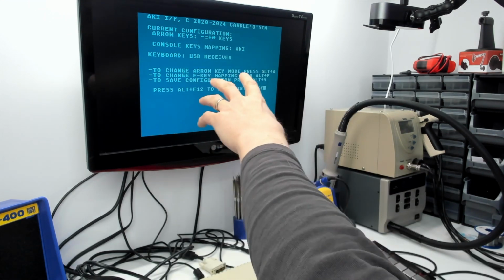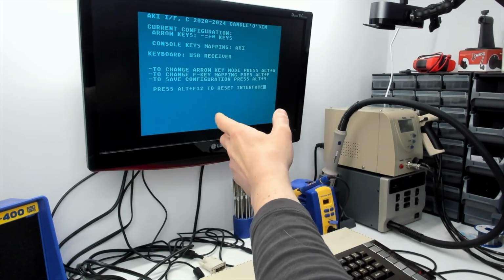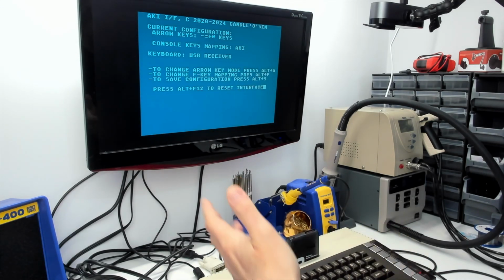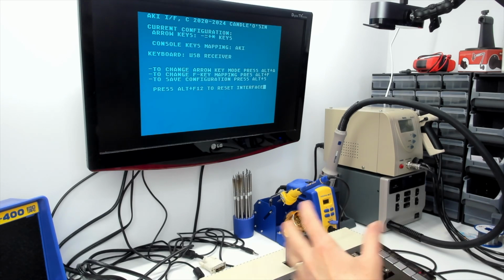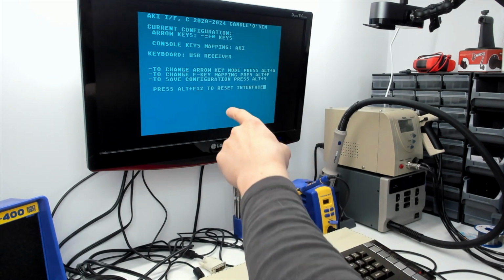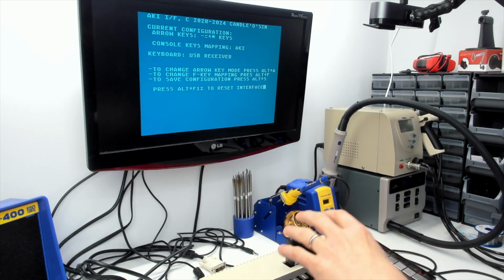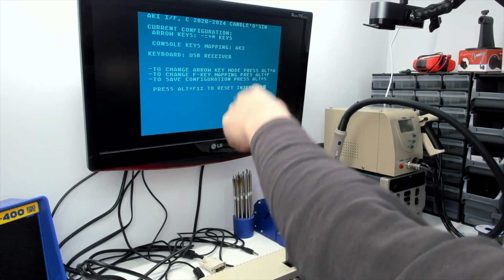Another thing you might notice is that every time we display this help text, the case of the text changes, it reverses. So one time it's in lowercase with a capitalization, and then the next time it'll all be in uppercase. So what I think's happening here, because the first time you display the screen, after just turning the machine on, the operating system handles the upper lower case of the keyboard with a flag, controlled by the caps key, of course. So what I think's being done here, I haven't actually talked to Candle about it and confirmed it, but I'm assuming what it does is it issues a caps keystroke designed to knock the keyboard into lower case, so to set the operating system keyboard case flag to lower case. And that allows it to display the keystrokes in lower case.